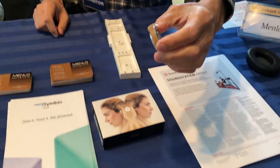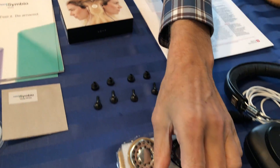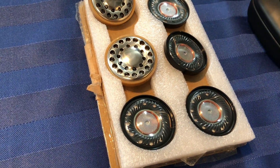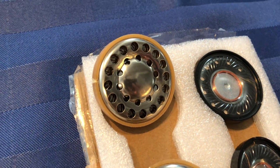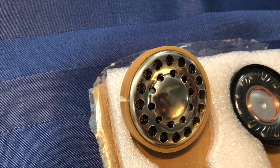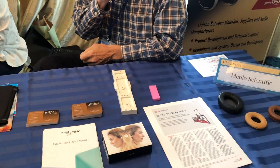It doesn't fix your driver, but in this case this is a 40mm driver where they're using this as the frame. For active noise cancellation, there's so much excursion and vibration when you're in a jet plane that it's doing all the work canceling even before it gets to the audio. That shakes up the driver and causes resonances. This material helps keep the frame very stiff. The cost of it is 10% more than typical polypropylene or polycarbonate — much less than nylon.